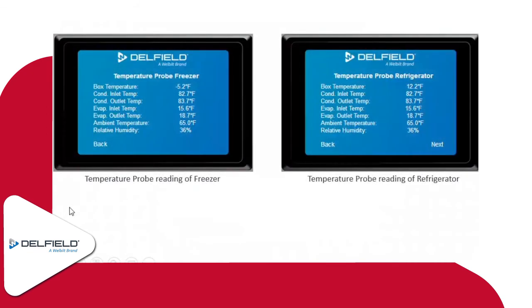As far as the probe readings, these are the different probes that we have on there: the box temp, inlet and outlet of both the evaporator and condenser coil, ambient temperature, and then relative humidity. You see it listed here at 36%. We do not have a probe installed on the refrigerators or freezers for the relative humidity. So that will always read 0%. There is an option to add it, but we don't have it as a standard feature there.